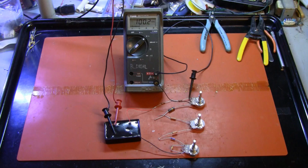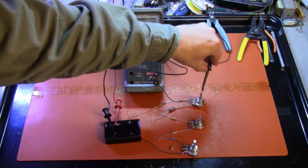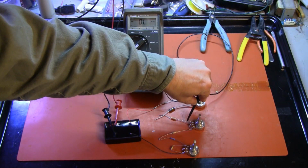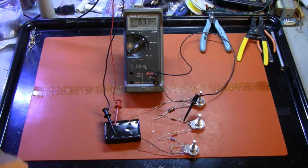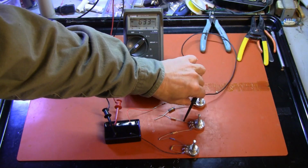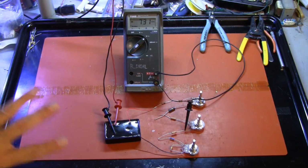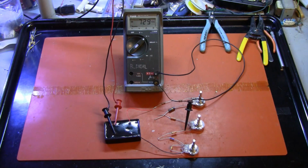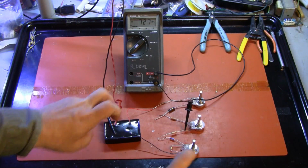So the next interesting point to look at is the top of the focus control. I'm going to risk my life and do this. And it is at minus 650 volts on the schematic. Let's see. Minus 637 is not that far off. Again, 5% tolerance here. The bottom of that control is minus 750. The reason I'm not getting zapped is this loop is not grounded anywhere in the house. It is a floater, in the famous words of Austin Powers. We've got a floater. So there's our minus 750.